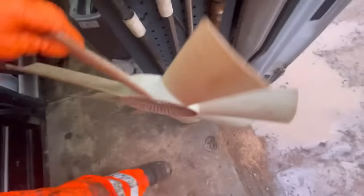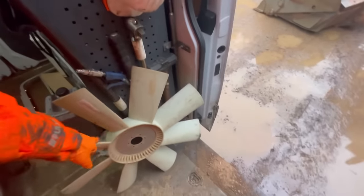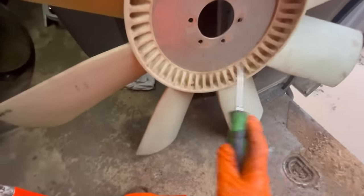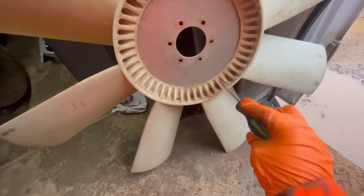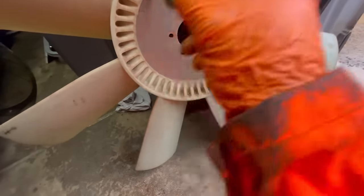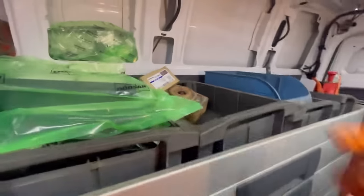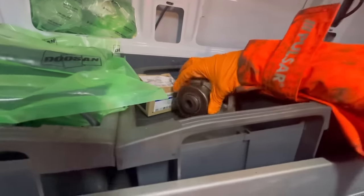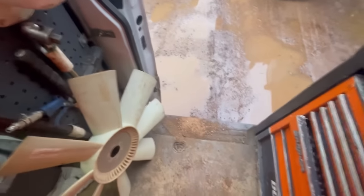I've gathered up all my bolts. The compressor's been building with air and I've been cleaning out these fins. Fans are always balanced, so if you've got a build-up of muck in these fins it might throw it off balance, and you'd expect the bearing to go. I think that bearing wasn't in great shape — there's no play on it and it spins freely, but there's a lot of gunk in there. I don't know why that's happened. I regret cleaning the fan out on the step.